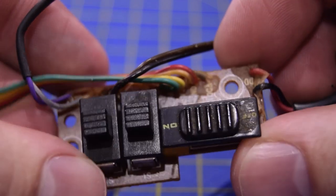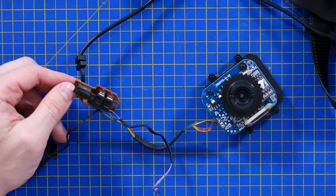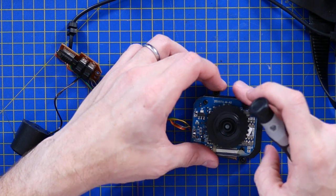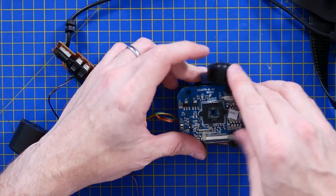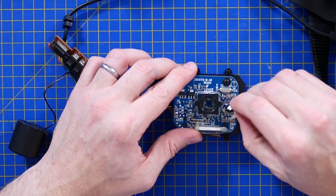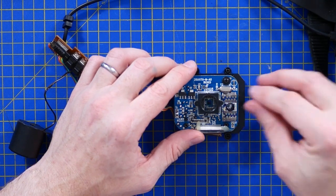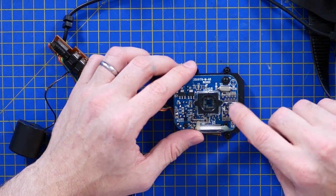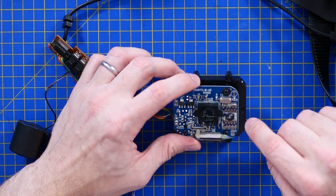So that's a one-way, two-position switch for the overlay — the green filter or true colour. And then you've got an actually focusable lens on the camera. What happens if we screw that right out? It will just come out and reveal the CCD — nice little lens stack in there. There's that daughterboard with a glop top on it. That application-specific integrated circuit — ASIC or glop top — was clearly something they brought in. I wonder if that's associated with image processing — could be display driving, or it could be both on a single chip.